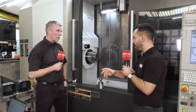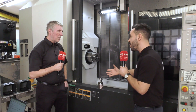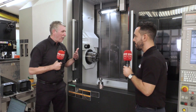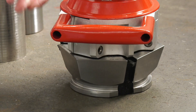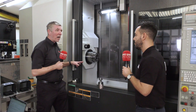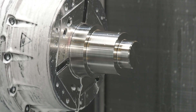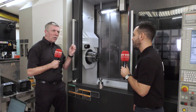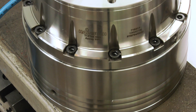How many people out there are running their machine tools without the right work holding? This comes up quite regularly. The theory of a three-jaw chuck is over 100 years old — invented by Cushman — and those things were invented when speeds and feeds were a fraction of what they are now. While they do lots of jobs okay, when you come to a specific job like this with hard material and you really want to hit it hard with a U-drill or something like that, you really need something a little more 21st century. Work holding is now starting to develop beyond the three-jaw chuck and become a 21st century product.